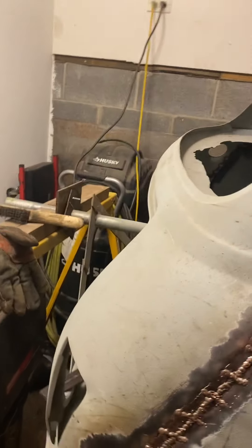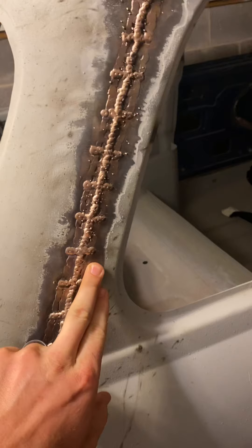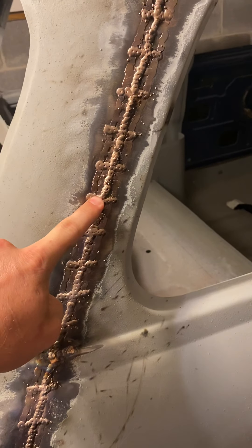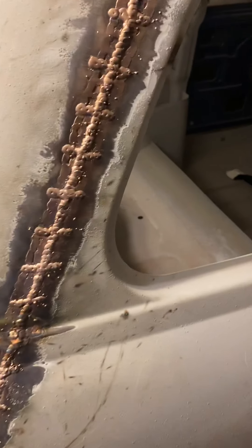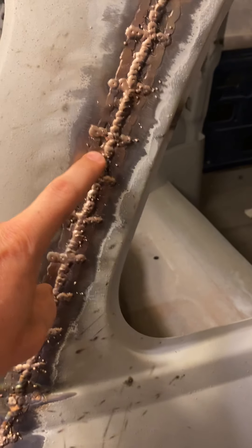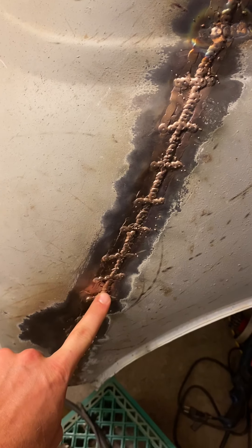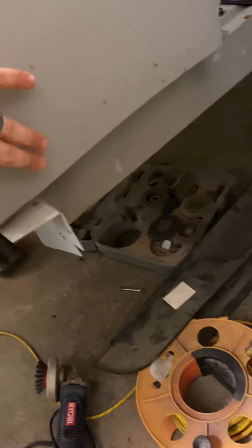So I filled them all up and raised them. This is silicon bronze. Please don't comment on this one — I know it looks pretty bad, but it'll be cleaned up. I will be leaving the actual seam and cross-stitches. The other side came out a lot better because this was trial stuff to see what was working. There's a little bit of warpage here that I need to get out, but up here it went really well. I plan to do this same thing on the front side seam and on the seam here when I cut this little bit off to do the lower panel.